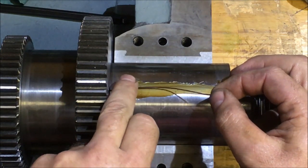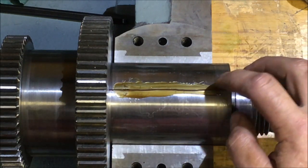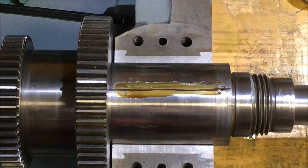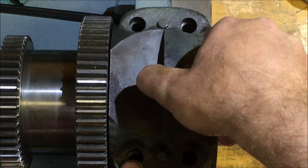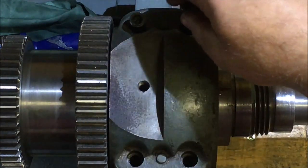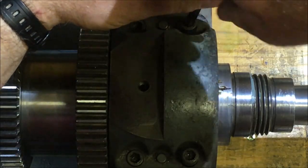It says cut it to the length, and I don't really see much point in chopping any off that. It also suggests spraying the top half of the bearing with release agent. I ain't got any. And it does say that the strips are oil soluble. So if you can't get all the bits off, it won't destroy your engine if you happen to be measuring up big ends and whatever. I'm not expecting much compression on this at all.